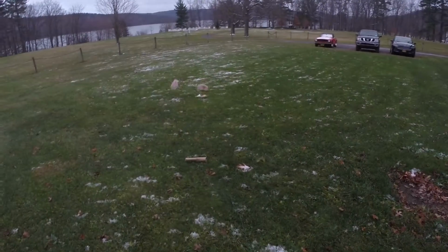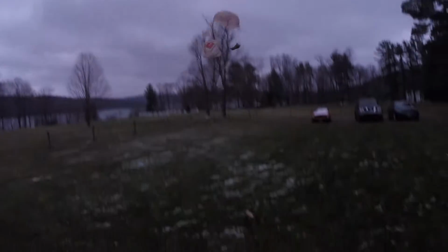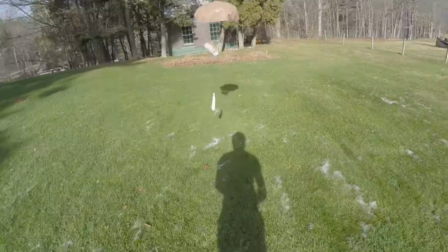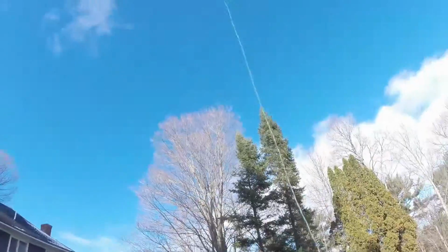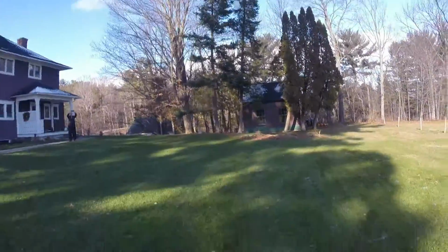In my testing of the parachutes with the various possible configurations and folding techniques, I found a few things. The first was that having multiple parachutes didn't help the overall reliability, as the necessary airspeed and drag to open any given chute would be cannibalized by the first one to open. Effectively, only one parachute would consistently open.